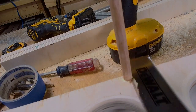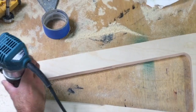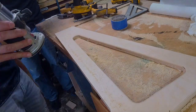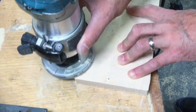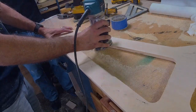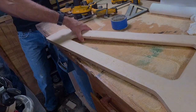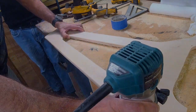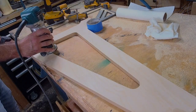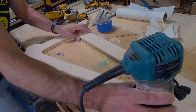When it's done, you can hardly tell. Rounding out all the edges, making everything smooth. Once these sides are done, we're going to go ahead and put the cross pieces on. Same as a couple of the other projects we do, we're going to glue and then screw the pieces together for a temporary hold before we put the dowels in.